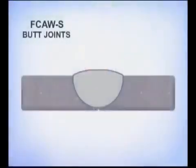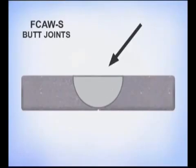If possible, try to position the thinner gauge metals to weld downhill. With downhill, you're welding away from the heated metal, limiting penetration and helping to avoid burning through. As the metal thickness increases, you want the amount of filler metal to equal the thickness of the base metal. The weld does need to penetrate deep, especially if there's any stress on the joint or you intend to grind the weld for a polished finish.